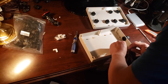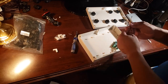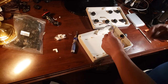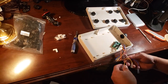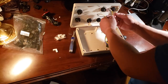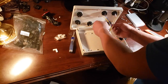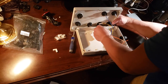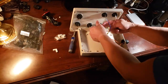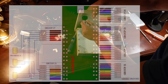First we're going to start on our circuit board, our control board, and then run wires to each of the buttons. What happens here is you have one wire that goes to each of the buttons, and then you have a daisy chain of wires connected from each button to a common ground on the circuit board.